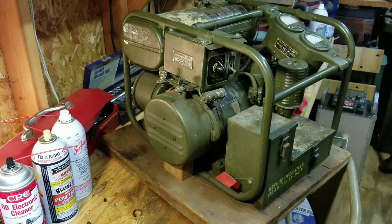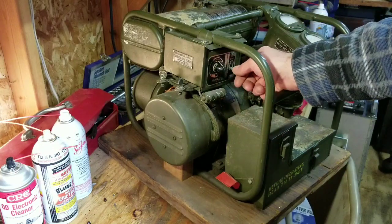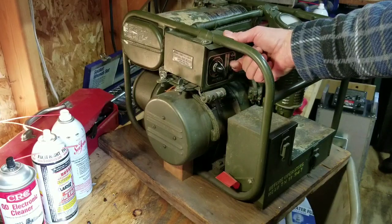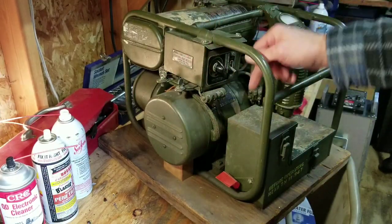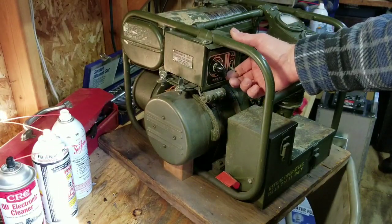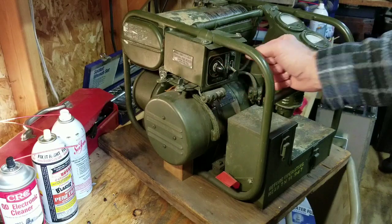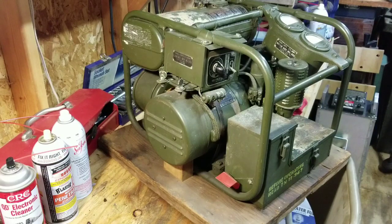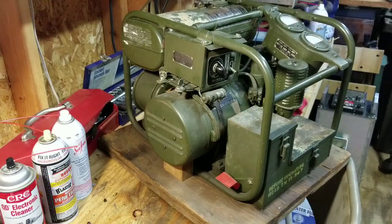This also allows you to reverse the current — if you have a charged 12 volt battery, you can actually start the motor with an electric start, passing the current through the generator itself to turn the crankcase flywheel. Alternately, there's a rope pull start on the other side. This was used to charge batteries of different voltages — 6, 12, 24 — and anyway, I had this thing running nearly perfectly, generating voltage, starting electrically, and reading the power output on this meter box. Then I noticed gas leaking out of the carburetor.